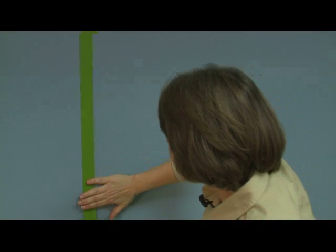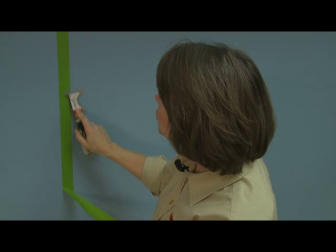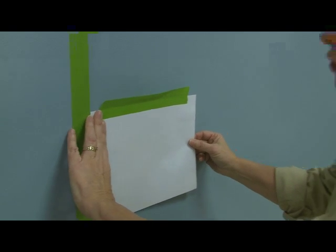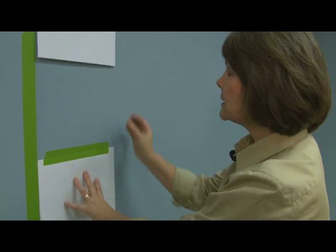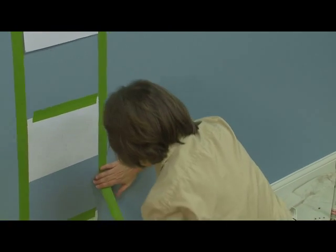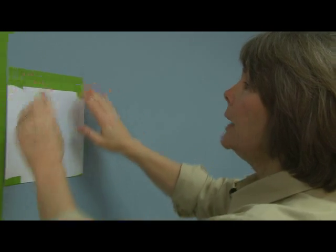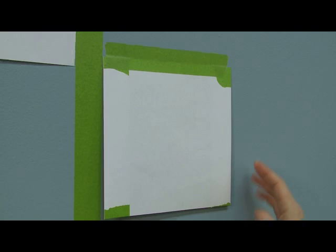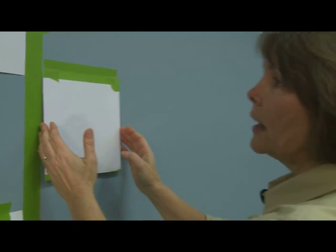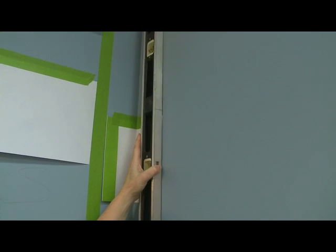Now it's time to apply the tape. Two things about applying masking tape to prevent bleed-through: first, do not stretch the tape as you apply it, and then after it's up, take a tool — a 10-in-1 tool or a putty knife — and just flatten out the edge where the paint is going to go. Because my stripes are going to be 11 inches wide, I'm using an 11-inch wide piece of paper as a spacer or template to show me where to put my next piece of tape. Then I can apply my next strip of tape using the edge of the paper as a guide. In order to have the space between my stripes be 11 inches also, I needed to accommodate for the tape widths, so I made another template that is three inches narrower than my 11-inch template. Each time you come to a corner, wrap your tape and then re-establish your plumb line, because corners are never perfect.